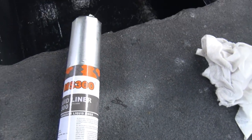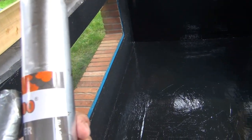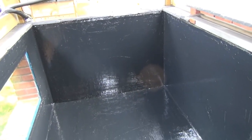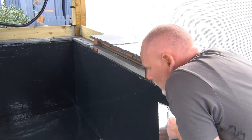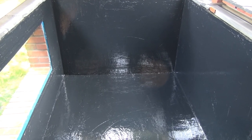So that's the job done folks. If we haven't mentioned it enough - MS 300 liquid liner. It's like MS 300 silicone but a lot more fluid, comes in a sausage, so you need a proper sausage gun. It applies easy enough - you might have a sore arm or sore shoulder next day from the troweling. Looking forward to seeing this fill back up with water and the lovely fish back in it. Thanks very much - we've had bacon sandwiches and loads of cups of tea too.